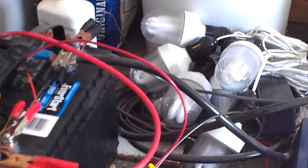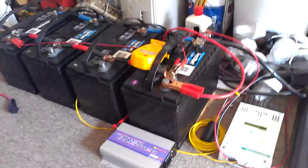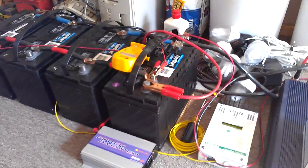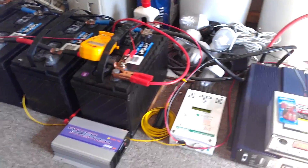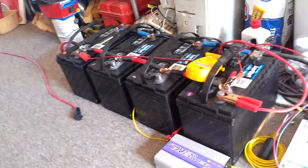From here on I think I'm going to get a project box, and probably get two 60-amp breakers so I can have the panels protected and the batteries protected. I'll probably also put two disconnects inside for each, because usually your breaker really shouldn't be used as a disconnect means.